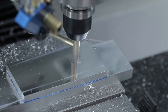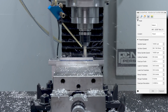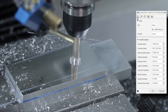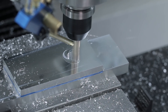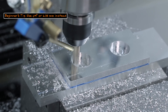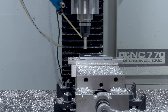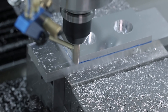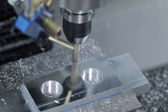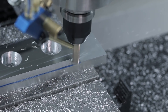Now this is interesting. Jared really likes using the 3/8 inch end mills here. We're running at 10,000 RPMs, 2 thousandths of an inch feed per tooth, and I have no problem with that. But if you're new to machining or you're new to a Tormach, I would recommend using a 1/4 inch. 3/8 inch can work really well, but the larger the diameter, the more likely it is you may incur chatter or higher tool pressure or just have problems. That tool is all that much more expensive, and you can run 1/4 inch tools far harder than most people realize. So stay away from the larger diameters unless you really know what you're doing or you need a really long depth of cut.